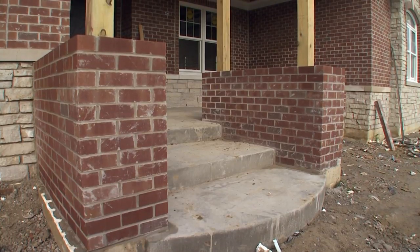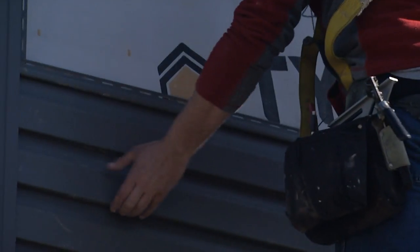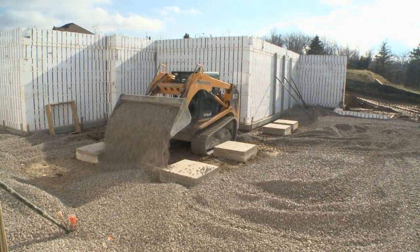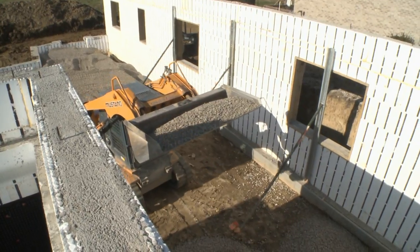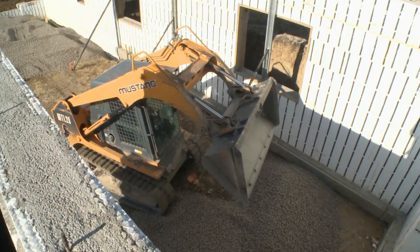Now, in terms of the building envelope, a lot of people think of it just as a physical structure they see above ground. But really, it kind of starts from the hole in the ground, doesn't it? Correct. If you imagine a box — that's your building — how many sides do you have? You've actually got six. You've got a roof, the sides — which could be brick, siding, glass curtain wall, or metal panel — and then the foundation and underneath the slab. You have to protect all of those different sides of the box. Basically, there are four basic layers to any performing enclosure.